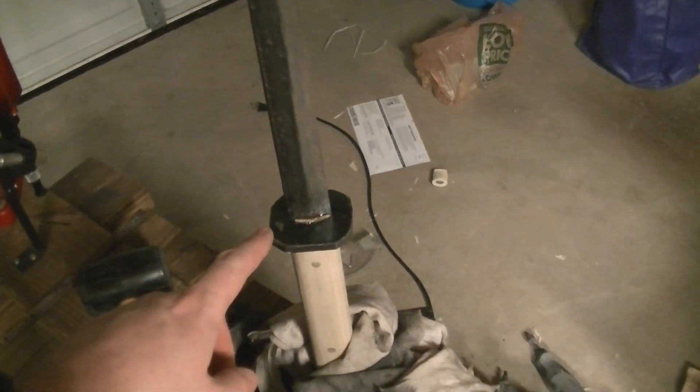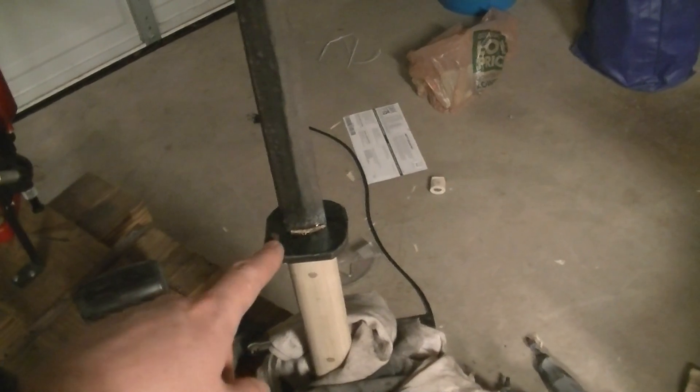I made the hand guard out of steel leaf spring. When I drilled it, the material was really hard — I finally drilled and filed it enough to get it on, but it was loose. So I took little wood pieces, like you'd put in the top of an axe, cut them specially, put epoxy on them, and hammered them in to lock it tight into place.